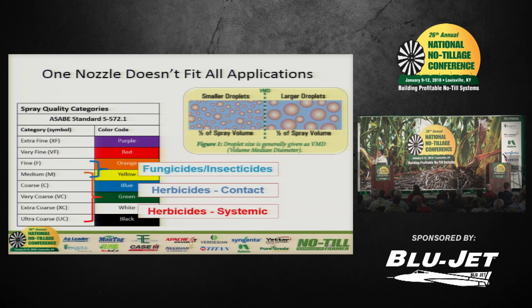Okay, a few final comments as we move through here. One nozzle does not fit all applications. My punchline. And what we have to base that on is this chart of droplet size, spray quality, ranging from extra fine down to ultra coarse. And the fact that we now have focus in our labels and in our products on how they function in the plant. We all know what the difference between contact and systemic is, and there's a lot of relationship that's going to go on here as we study our nozzles and how we use them.